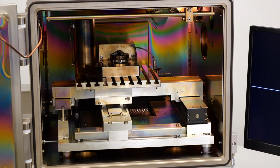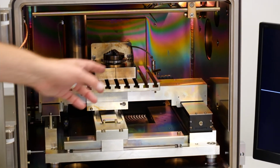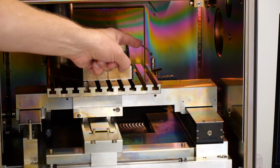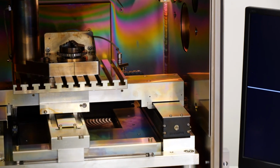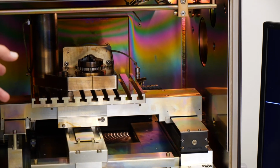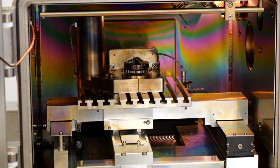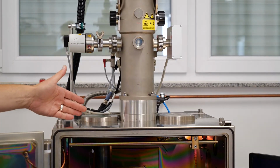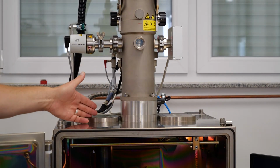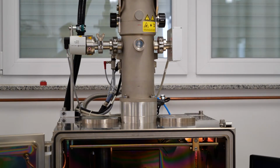The rotary unit is an optional item. You can either leave it on or take it off. You only unplug that little cable which you can see in the corner, which gives the motor the power. That's all you need to do. You take an Allen key and fix it to the T-nut plate, or you fix your own workpiece holders to that plate. We have 3 flanges on this machine, so you'll be able to put it here, here, or to the right-hand side. It's just physical remounting, and of course it's not so convenient. I think most people leave it in the center as it is.